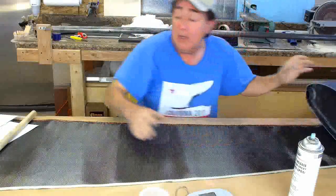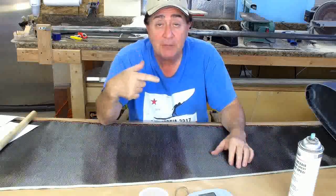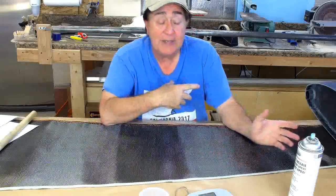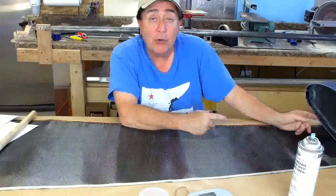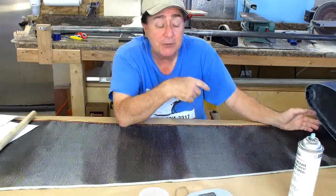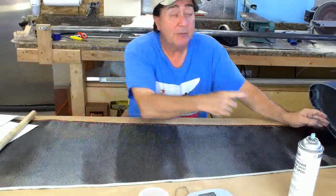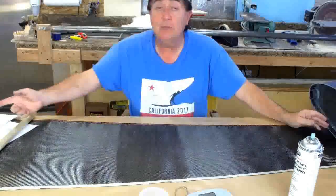By tapering the cloth, 20 inches at that end on an inch-and-a-half diameter will give me the four layers I need at that attachment point. Outboard, I have 10 inches, which would give me just a little over two wraps around the tube. So we have a straight taper from one end to the other, going from two layers thick — 20 thousandths — to 40 thousandths.